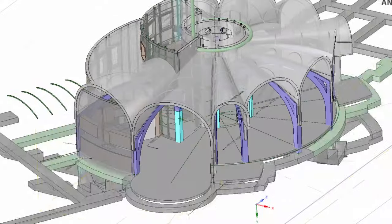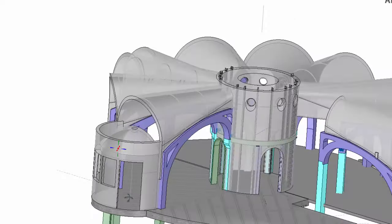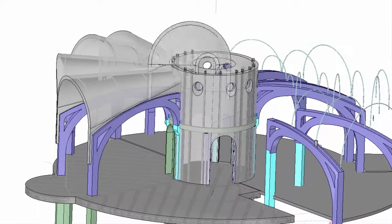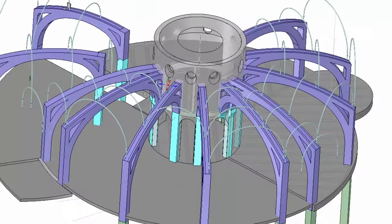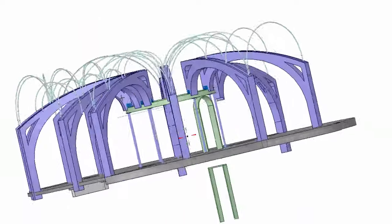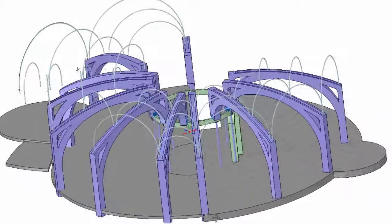For this video, let's go back to the computer model. If we get rid of all the peripheral stuff, the core of this design is radial vaults around a central tower. I need the load from the earth above the vaults to be carried to the footings while allowing this open concept living space in between them, and the solution was to support the vaults with these Euclidean egg-shaped concrete ribs. The inside end of these ribs will sit on the steel compression ring that will help distribute the load to the tower and steel posts and ultimately down into the footings.